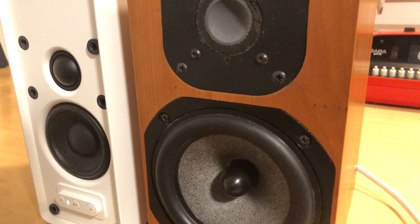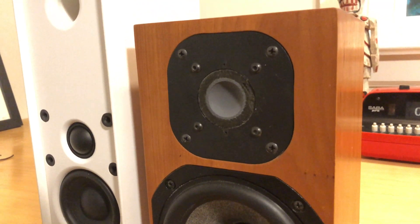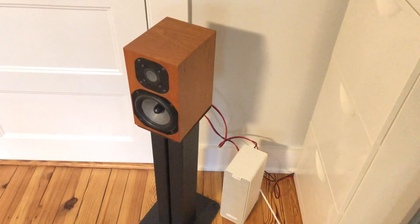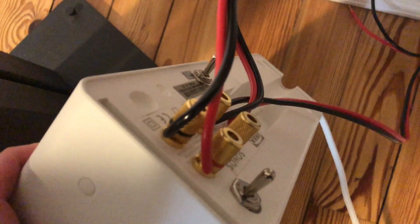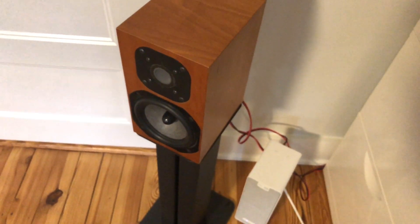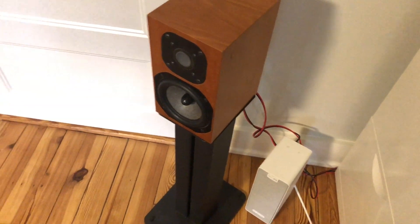We now have our Symphonic speaker with the switches turned to the off position, so I'm really just using this as two power amplifiers with a built-in electronic crossover to route things to the woofer and the tweeter. I went ahead and set these up on speaker stands. Looking around back you can see how these are wired up — the top binding post attaches to the tweeter, the bottom to the woofer, connected with 12-gauge wire down to the binding posts on the back of the Sonos speaker. Obviously this is not a permanent installation — this is mostly so I can tinker around. You could even take the amplifiers out of the Sonos speaker and mount them into a larger set of cabinets, but for now I just wanted to play around.